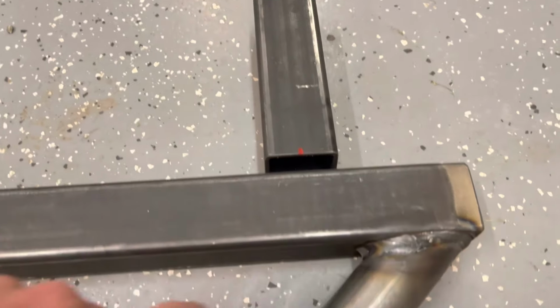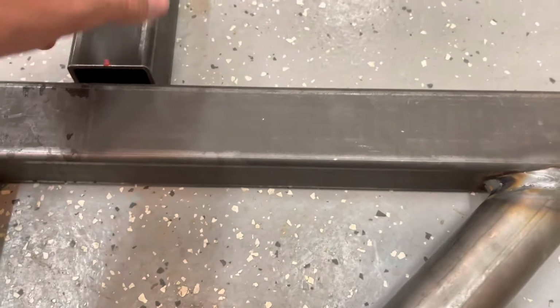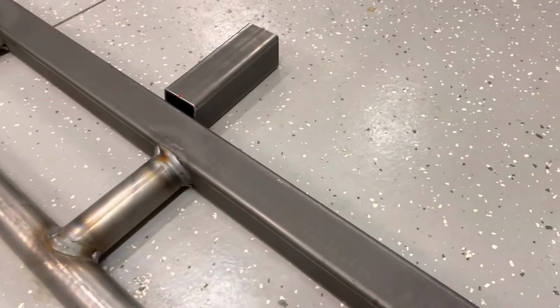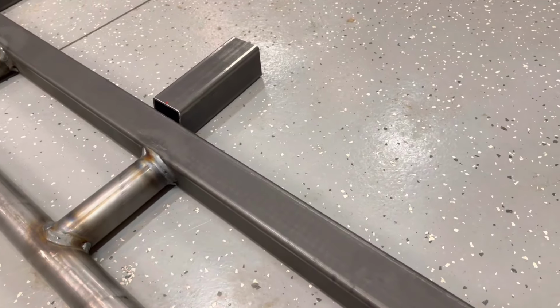4X says that you can't go more than 12 inches on the front leg or the back leg. So I'm just gonna measure from here to 10 inches and then center it on 10 on both the ends. And then the center, we're just gonna measure this thing, which is 66 inches long, mark a line center, and then tack that one in center.